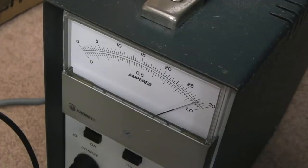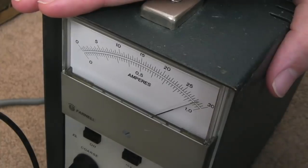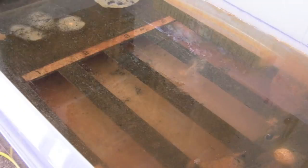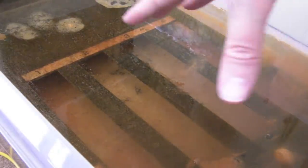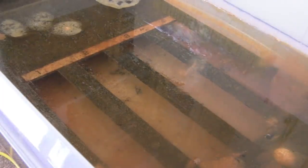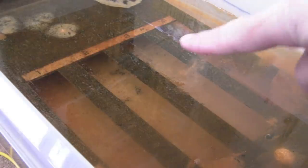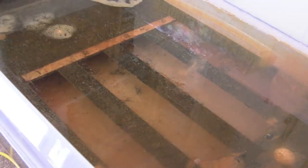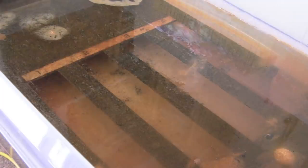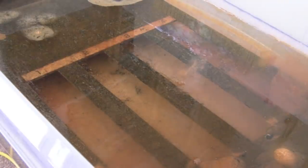I did add some more sodium carbonate in there to speed up the process a little bit. One funny thing, and I didn't capture it: when I added it in, the powder landed on various places, and it crystallized. It crystallized because of the electrolysis process going on. I had to then use a plastic tool to chip off all the crystallized sodium carbonate, I'm presuming that's what it was. Then it eventually started to disintegrate. But yeah, that was a funny mistake. It was all big clumps of solid white stuff stuck on there. I thought, oh my god.